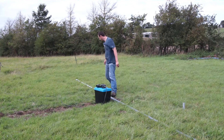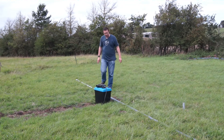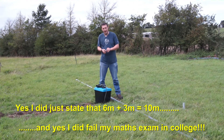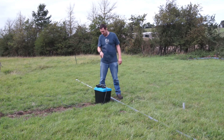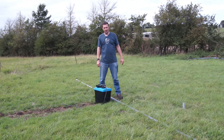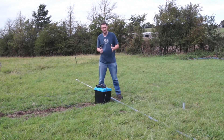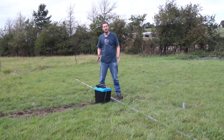I've actually extended the mast with about another three metres so my antenna is going to be about 10 metres off the ground, so feeder cable there about 10 metres. I might have to have a quick connection point anyway because I don't leave the radios down here and I quite often run it into the caravan, so I'll bring that feeder cable to the base of the mast and then just a quick run into the caravan. So shortest run possible, highest antenna possible - it's a bit of a balance between the two - and the lowest loss coax you can possibly find. Absolutely critical.